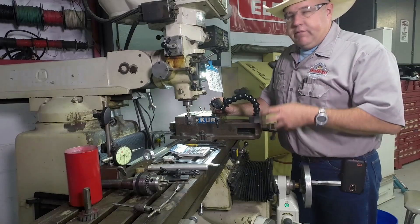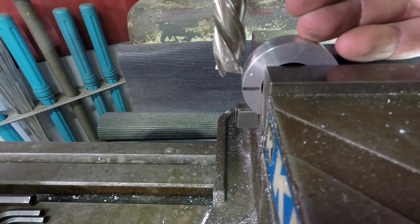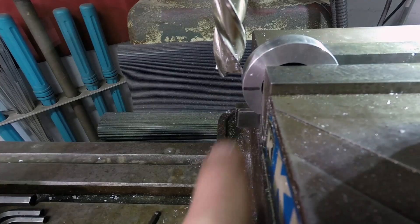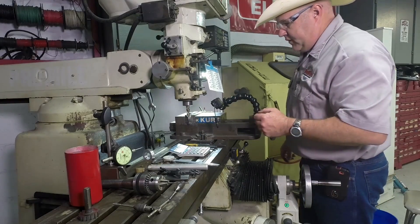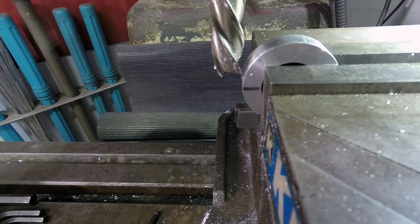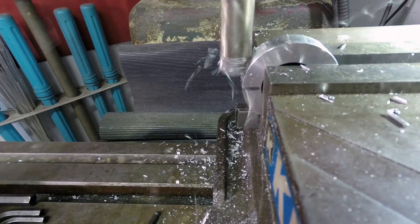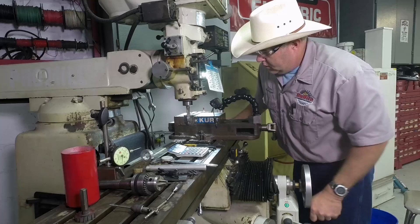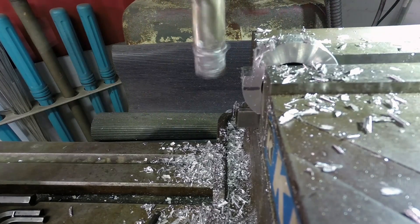This part's coming along good. We're going to machine the relief groove for the clamp part of the little generator holder. Essentially I found center, and I'm a quarter inch off the center line — you can see I marked it here. So I'm a quarter inch above that, and I'm going to set this and we're going to go three tenths — three hundred thousandths — in that direction. That's going to be our little land to put the bolt in. Now that we're in here, unlock the table, clean those little edges up, and we are done with that operation.